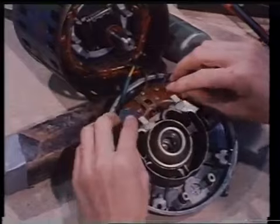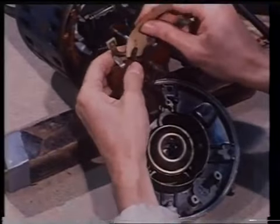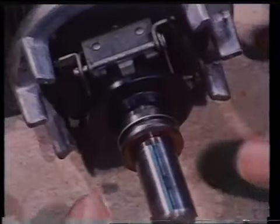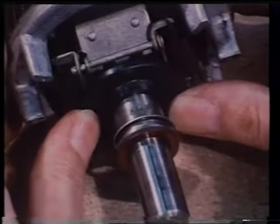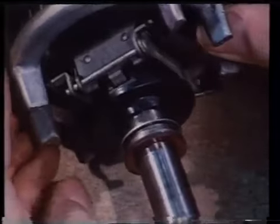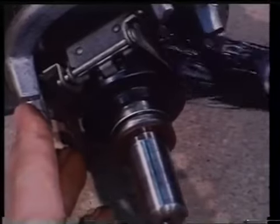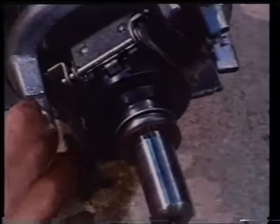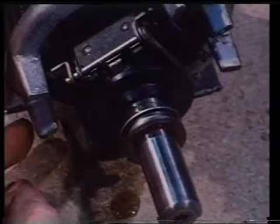For instance, the centrifugal switch contacts which disconnect the motor's start winding at full speed must be checked and cleaned and the switch mechanism checked for easy movement. First, clean the mechanism with an approved cleaner. Then apply lubricant sparingly and wipe off surplus oil.